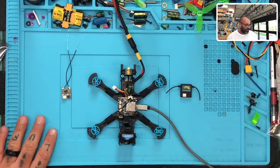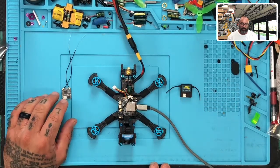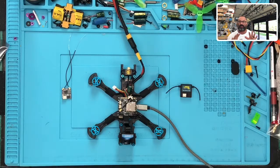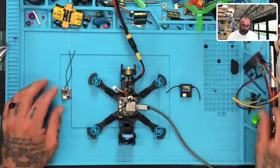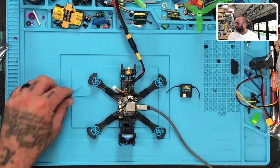Here's the deal. The issue is coming into play that we're trying to do this in DSMX protocol and not DSM2, and it's failing. On the diversity one it's failing, but on the non-diversity satellite receiver it's working fine. So let me show you what I'm experiencing — I'm doing this for the customer too. I told him I would show him what we've been going through.